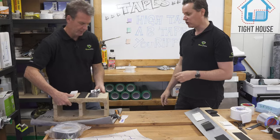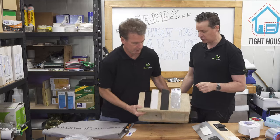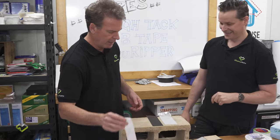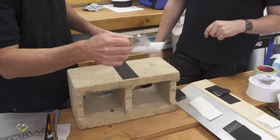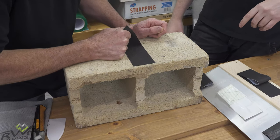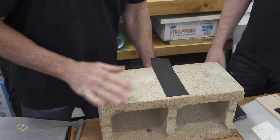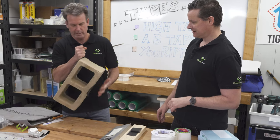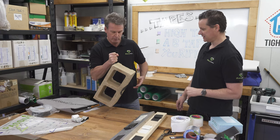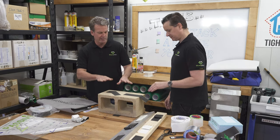Blockwork and concrete are very porous materials — in many circumstances they're not airtight themselves. Cloth tapes and silver foil tapes don't have enough glue load for these surfaces. Hi-Tac gets really good adhesion to blockwork — so good that you can actually carry a 200mm series block weighing about 13-14 kilos using just a strip of this tape. Insane.